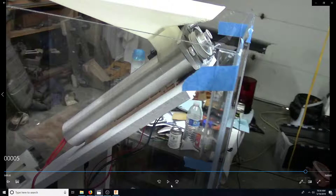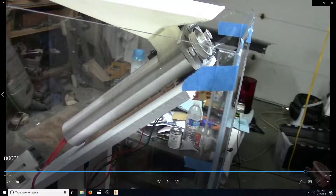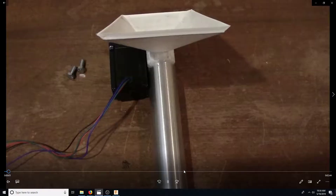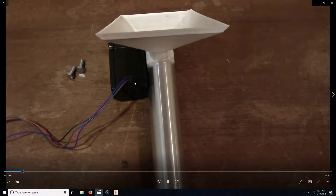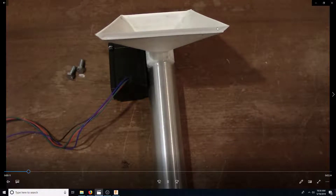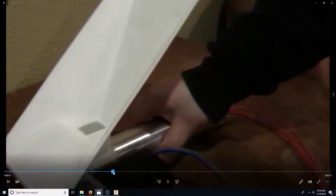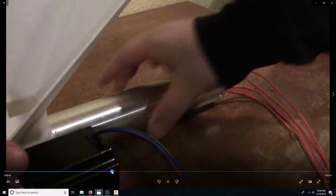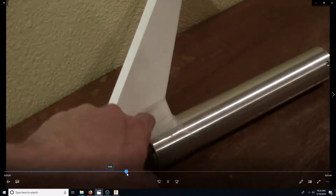You put pellets in here — there's a hole where the filament goes. Let's open the other video showing the exploded view. Here I'm going over the barrel itself — the barrel is currently unbolted as you can see it twists. Here is the hopper itself, which theoretically fits one kilogram — though with air gaps it won't fit exactly one kilogram. Here is how the motor's bolted up to the torque plate, as I call it. I took off the 60-tooth pulley and here you can see the start of the screw.